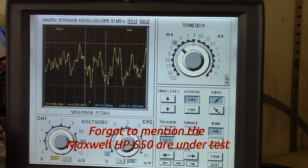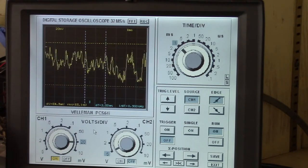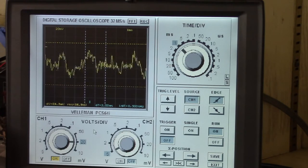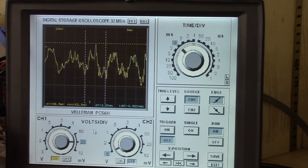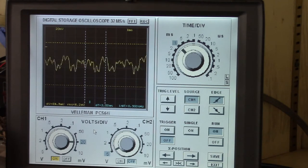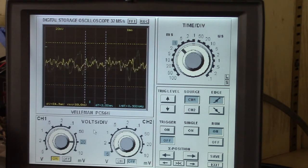So I'll let this run for a little while here, and then I'll put on the 1920s headset. So the big thing here is RMS voltage. I guess what I'm basically saying is I'm really quite surprised how little signal is actually put out by a little MP3 player, a cell phone headphone jack voltage. It looks like if you drive it really hard, it might come out to like 1.5 volts or something like that. And right now I have the volume set about 3/4 of that, roughly.